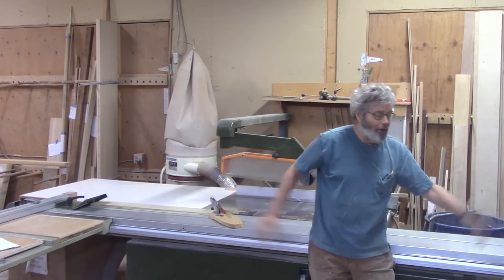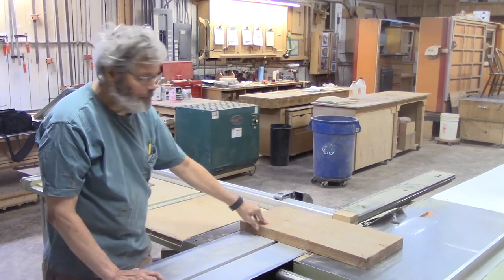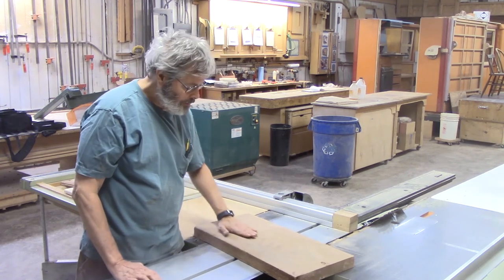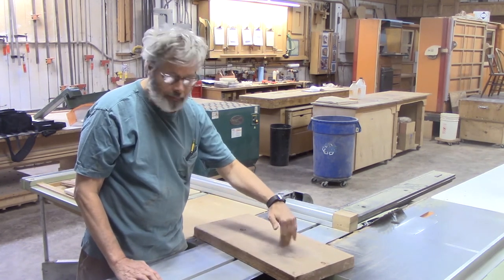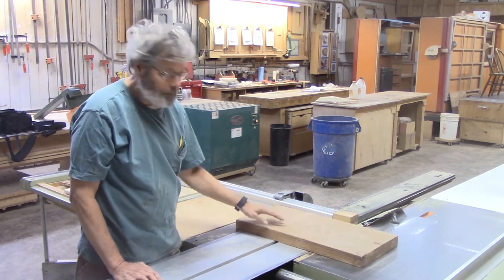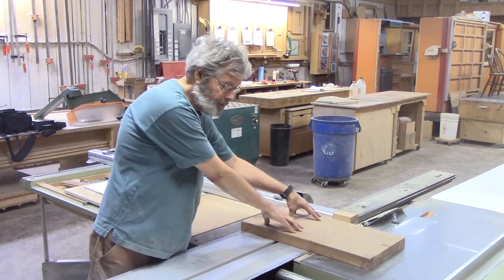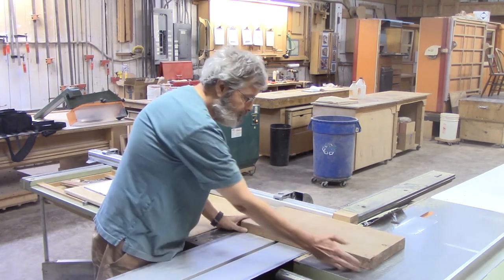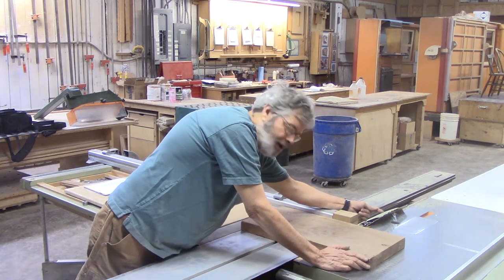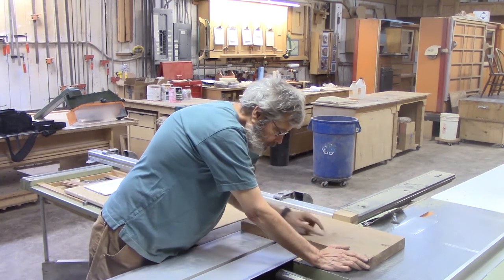You don't have to push it from any specific location — you can push it from anywhere. With this saw you can also do a form of bevel miter called a waterfall fold, where the grain just folds and goes down. This is done the same way as any other cross cut, but you have to pay attention to holding the piece down — because if it starts to lift, it actually cuts further as the blade is not straight up and down, and you get a curve on your cut.